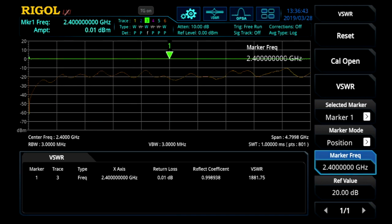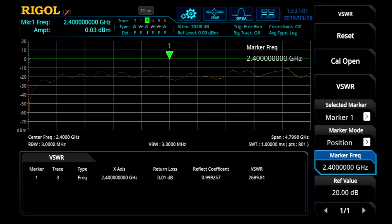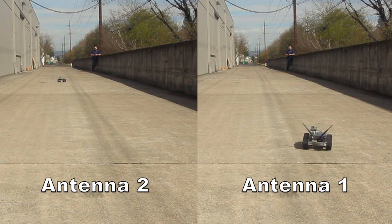And the next antenna on the second set is showing a VSWR right around 11.12. Based on our VSWR measurements, the first set of antennas should perform significantly better than the second set in terms of distance. We tested both sets of antennas on the robot to confirm that the first set will allow the robot to travel farther than the second set. With the combination of antenna tests like VSWR testing and real-world testing, we are able to determine the best set of antennas for our robot.